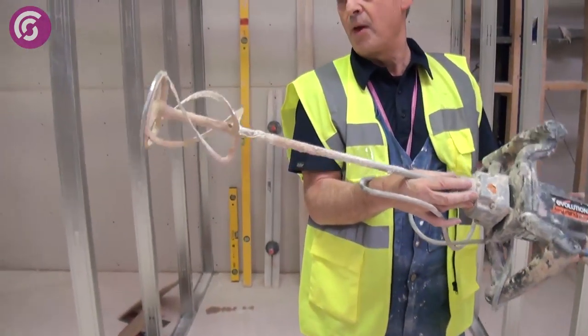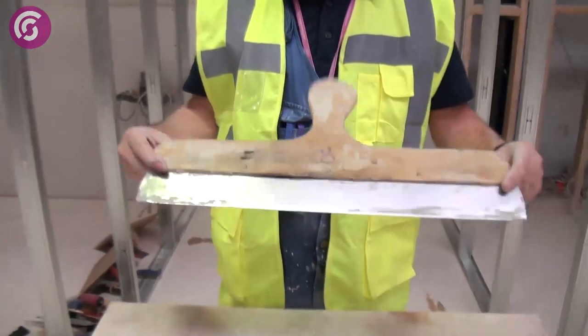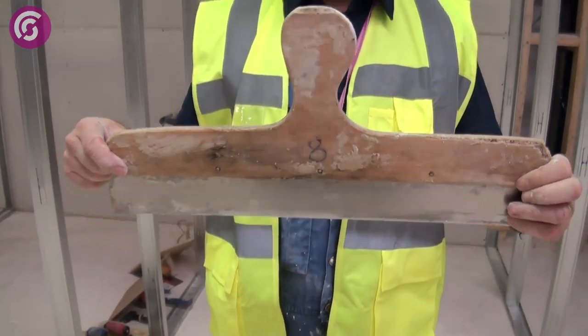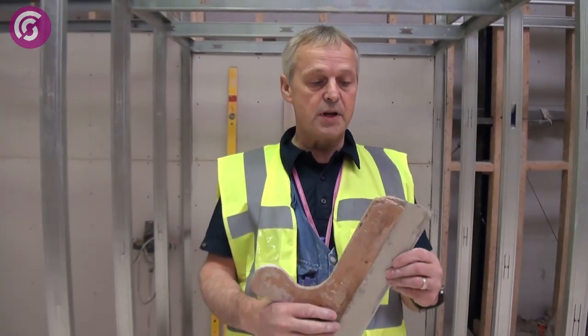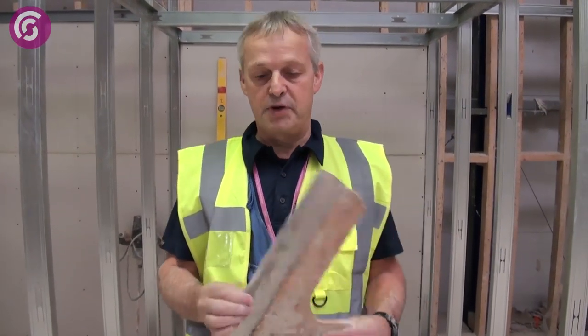The whisk ranges in cost from about £100 up to £400. This is called a spatula, and it is used in conjunction with the sponge float. You lay on your one-coat plaster work, then go over with the spatula to bring it up to a fine surface, and trowel in the fine aggregate as the work proceeds.